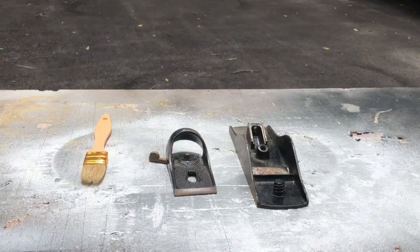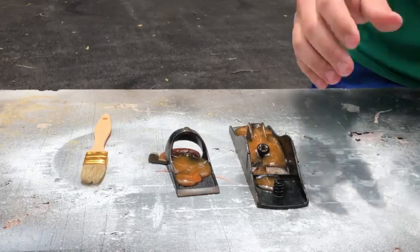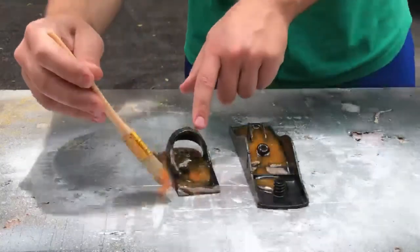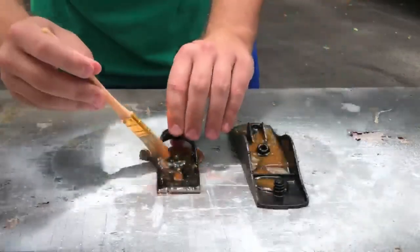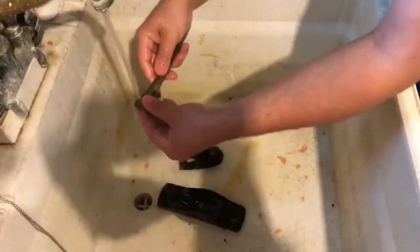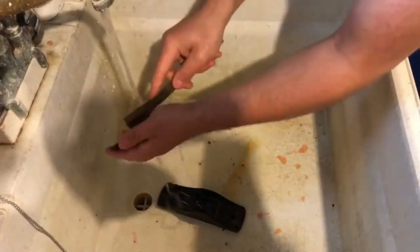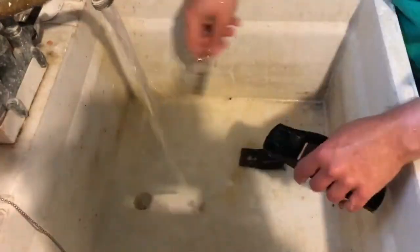Speaking of removing things, let's get into removing this paint. I'm using a gel paint stripper called Citrus Strip, which is really helpful for removing old paint off of projects like this. I'm doing it outside because I'm flicking it around a lot with a brush, and this chemical is really strong — I don't want to get it on a car or anything with paint on it because it will remove that paint as well. Once everything has a coating on it I'll leave it sit for an hour or two, then wash it off and see the results. I'm going to rinse it off with water while scrubbing with a wire brush to remove all the loose paint. I knew it wouldn't take off 100% — it usually takes a few applications for this to really work.